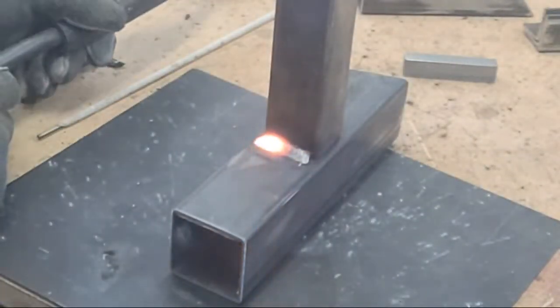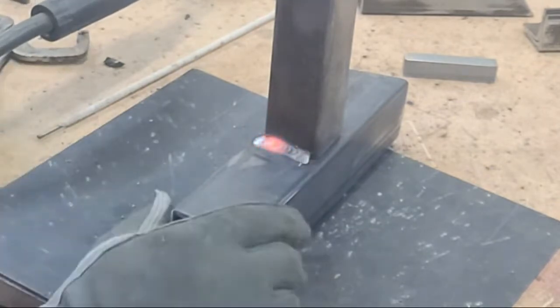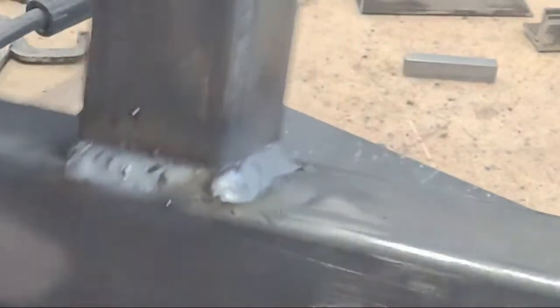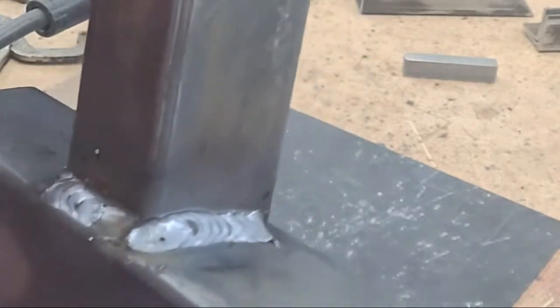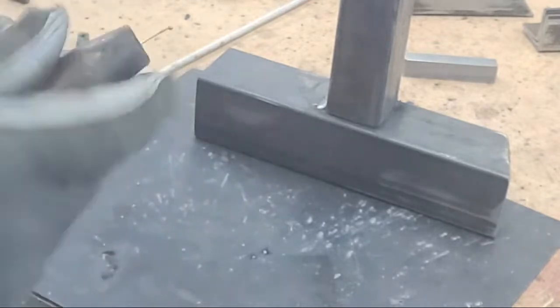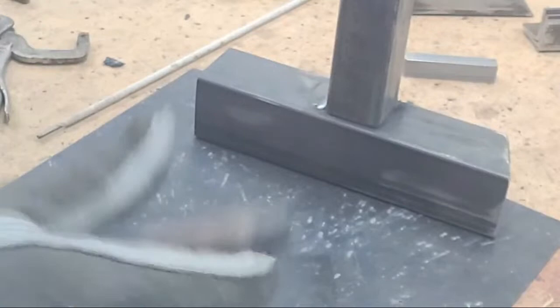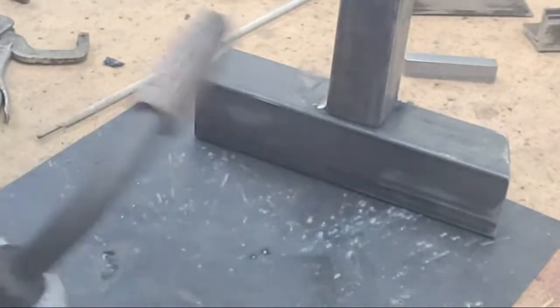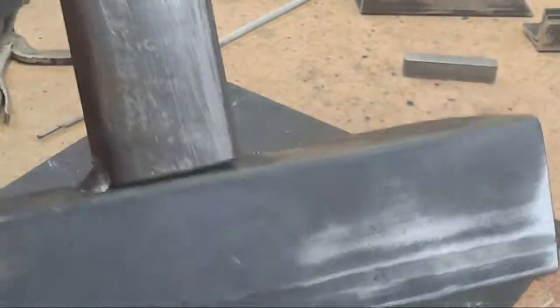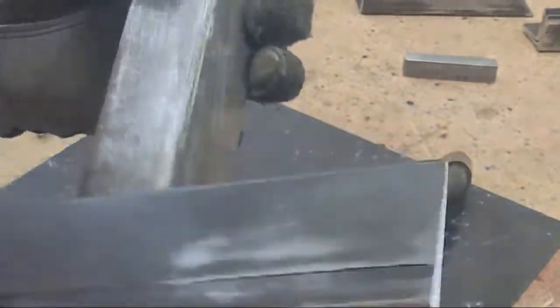Right now, I just want to tell you — you're getting sparks over here and I've got gunpowder in the corner, and it's all covered up. So please don't fire me up over here, this could be an explosive situation. Anyway, you guys can see those two welds look pretty much identical — not really a lot of difference. I'm using 030 wire — a little bit smaller — because every now and then I'll do some body work on someone's vehicle and it's great for sheet metal. I do a lot of this tubing welding too. I'm fixing to weld up this gap here — it's a pretty good gap, and this is why welders love wire welders: we can fill those gaps easily, no problem.